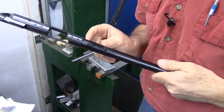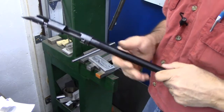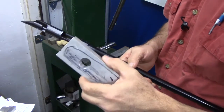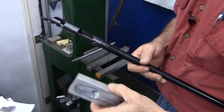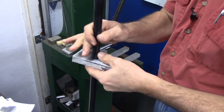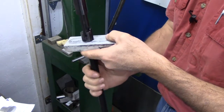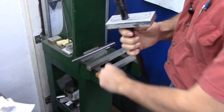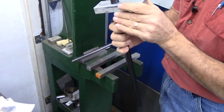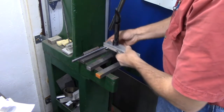The end of the barrel at the chamber end measures .866 inches, and I took a block of aluminum, drilled a 7/8-inch hole through at .875, and that is going to be my collar for pressing off of. If you just try to use a couple of parallels and catch the edge of that without a collar all the way around, you're going to screw it up. No ifs, ands, or buts.